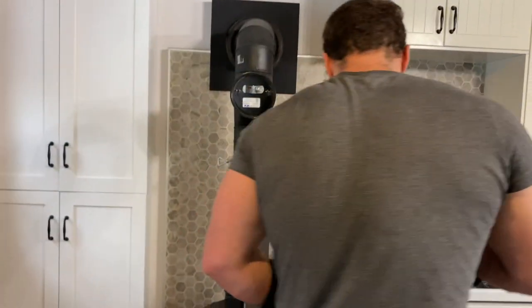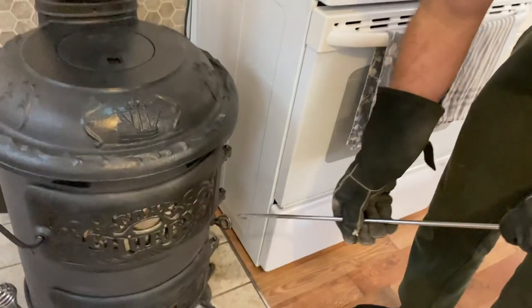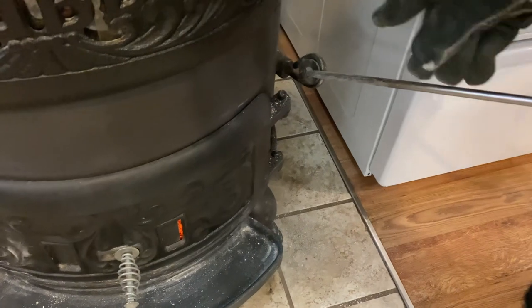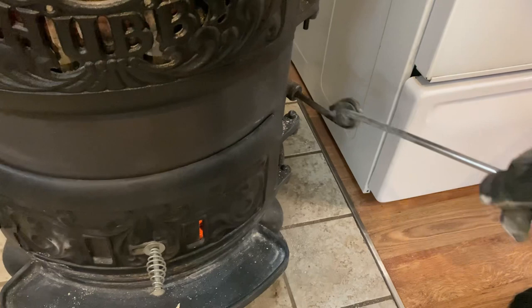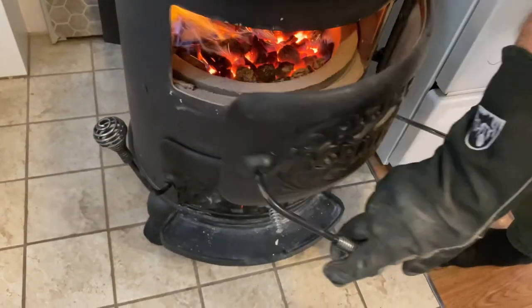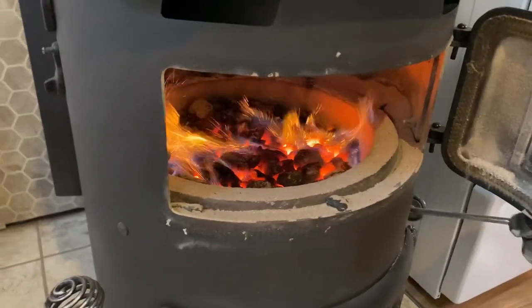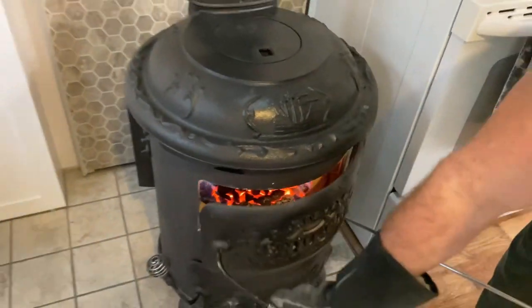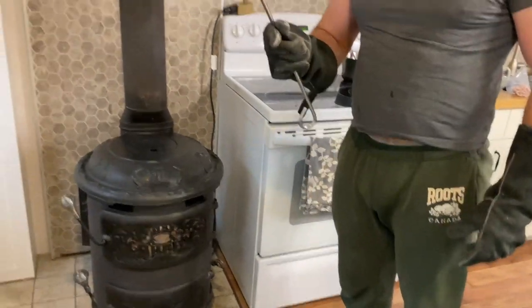Shaking down the ash is always done over here by taking that same fire poker and sliding it into the hole in this handle built into the side of the stove and then sliding that back and forth. What that does is rotate the grate that holds the coals and shake those coals so that the ash falls down into the ash pan, where it will sit for the next 12 hours until you service again.